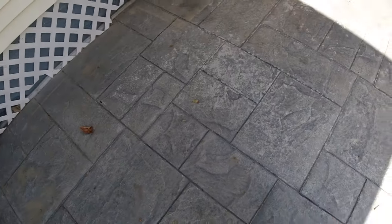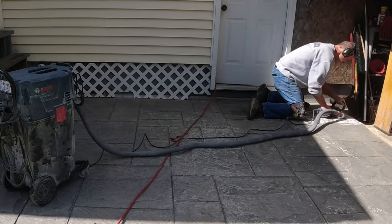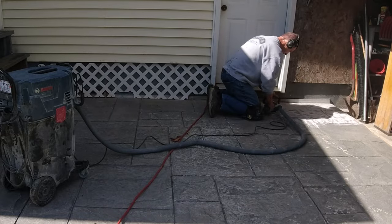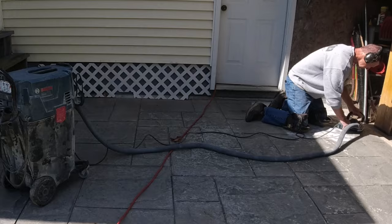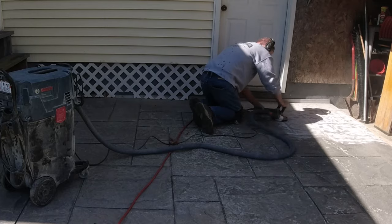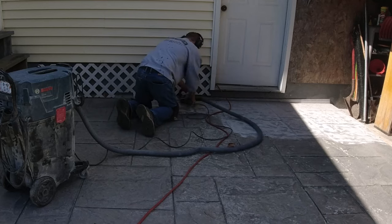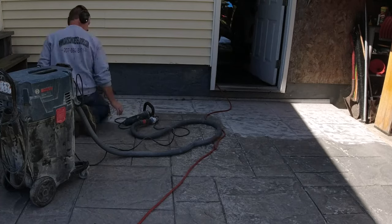Thanks for tuning in. I did this stamped concrete a few years ago and for whatever reason it got some freeze and thaw damage, so we're going to just overlay it and fix it. I'm not a big fan of trying to repair and patch stamped concrete — although it can be done, it's really hard to disguise it and make it look like the original, so it kind of looks like a patch. We're using Deco Crete stampable concrete overlay and we're going to resurface the whole thing and re-stamp it — actually a different pattern. The homeowner gave us a little freedom to do whatever we wanted out back.